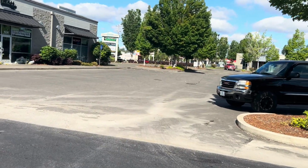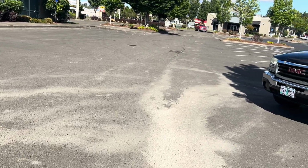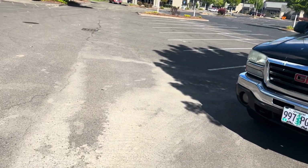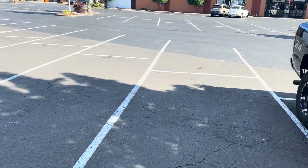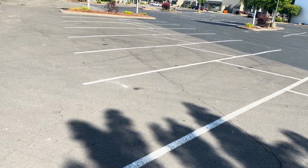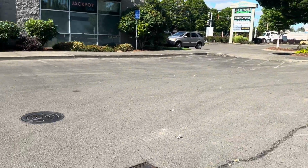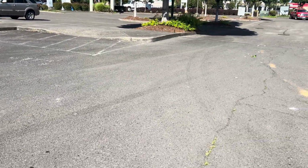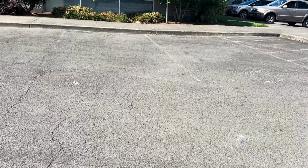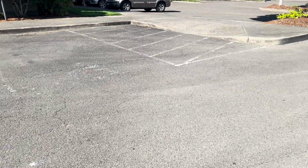Based off of the work order, this job is not warranted. And I'll show you why in a minute. So everything that we're covering up, we're going to follow this seam. Everything we're covering up, we're putting back, striping. Now the striping out here is faded, so faded it's hard to see. Definitely set markers for yourself and mark the curb before you start throwing down any sealer.